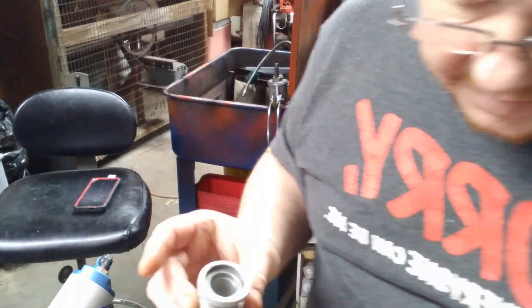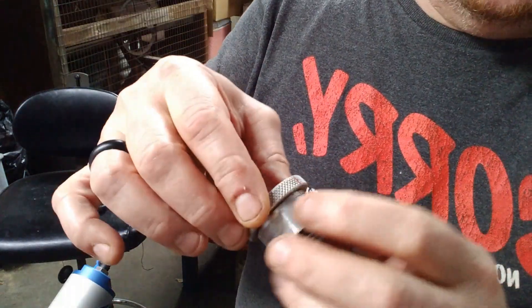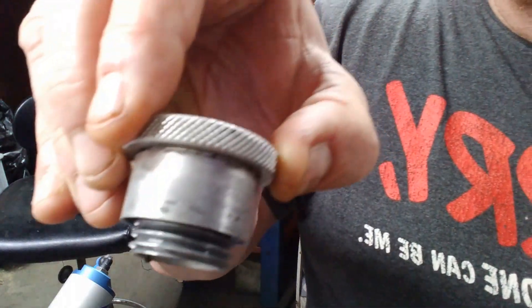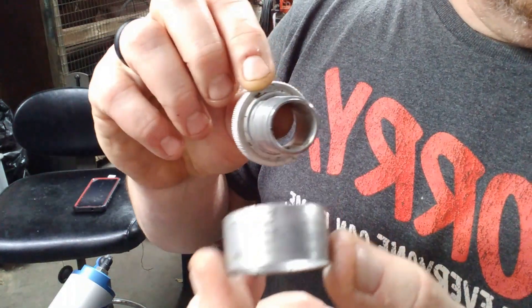You can see that little red line is lined up with zero. Now what we're going to do is take this thing apart. This inner sleeve — at least on every one I've gotten — the inner vernier can actually be popped off, and they pop off quite easily. Take a light hammer and tap it. You'll start to get a little gap, and then you can take a small screwdriver, get up underneath it, and pop it off. That inner barrel pops off just like that.